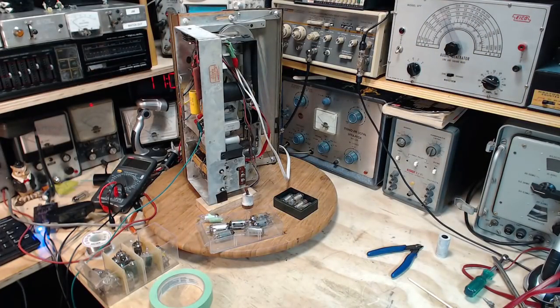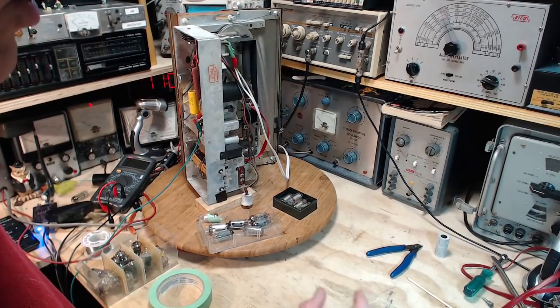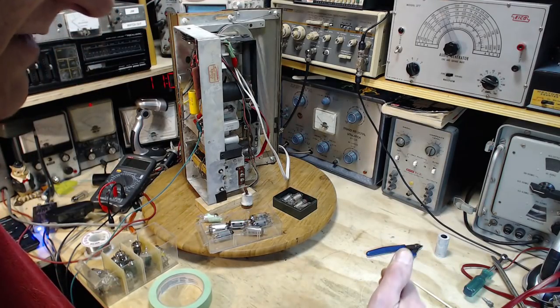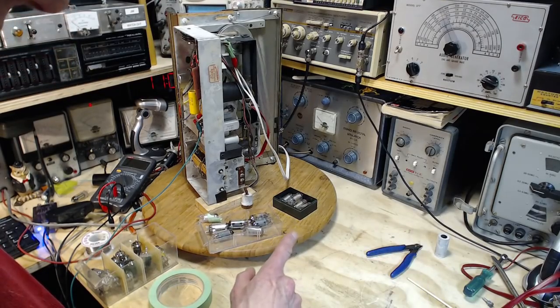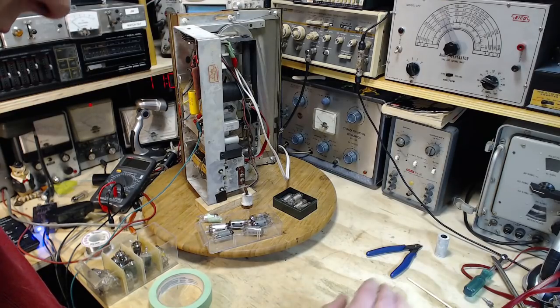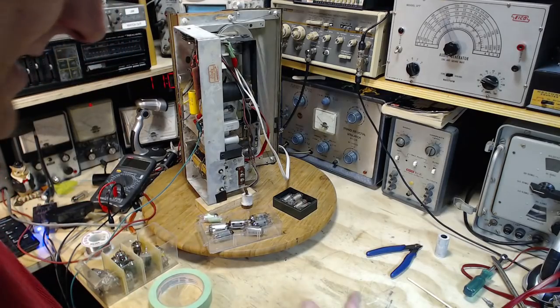Now, what could happen there? There's resistors in parallel, so it's providing a parallel path, and the resistance values are low. The heater's showing up around 10 ohms. The resistors are about 10 times that, 50 to 100 ohms. So a small portion of the current sneaks through the resistor, not through the heater. If you were designing a radio, you'd want that. You wouldn't want piles of current going through these resistors, because that's where the heat would develop. You want the heat inside the tubes.